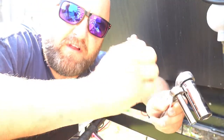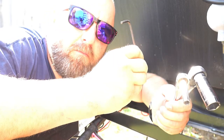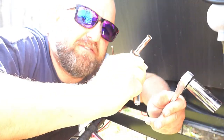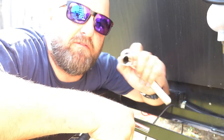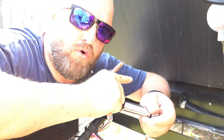I forgot to mention at the start: I'm using a metric 4 allen wrench for the bolt heads, a 5/16 socket for the nut, and for the disconnect switch a 17 millimeter socket for the two nuts inside. I used a quarter-inch drill bit to make the holes.